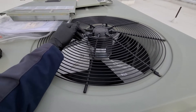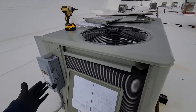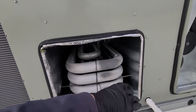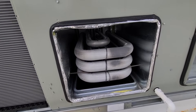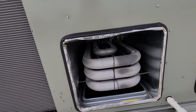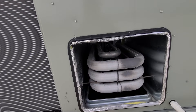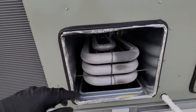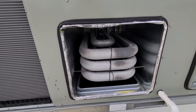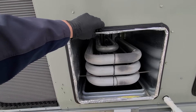We have our condensing fan motor and blade up here, and our disconnect right here — I have it off right now to kill power to the unit. Over here we have our heat exchanger compartment, which is really convenient for maintenance — you pull this little panel off with four screws and you can get in here and inspect for cracks. It's nice for maintenance access, and when you're replacing a heat exchanger it makes it easier. When I do fire-offs, I put the panel in there so the burning-off oils exhaust out on the roof and you're not stinking out the space below — especially important with commercial buildings tied into alarm and fire systems.